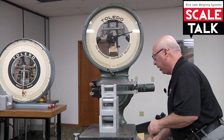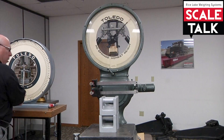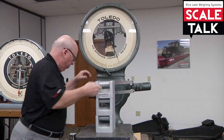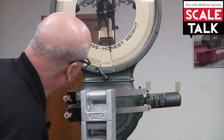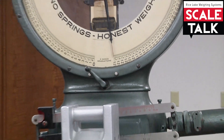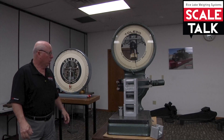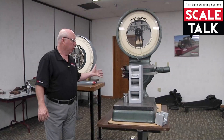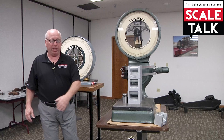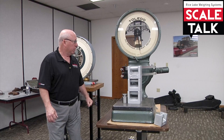I'll take the 10 off, and now we've got 80, 100, 120, and five more — going to full capacity at 125. You can see that this scale is pretty doggone close; I really perceive no detectable error here. We would now go through the rest of any other testing and trimming. Obviously, this calibration would be done after the shift test is good and after the scale has good repeatability. And that's a wrap.